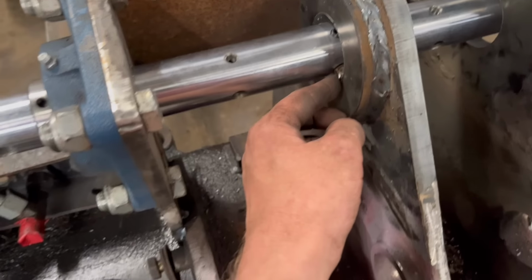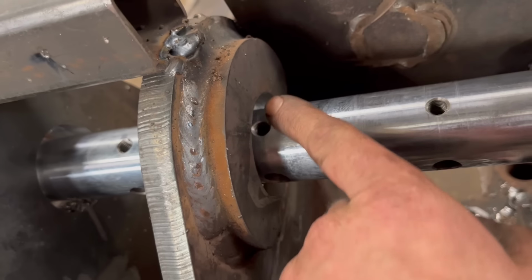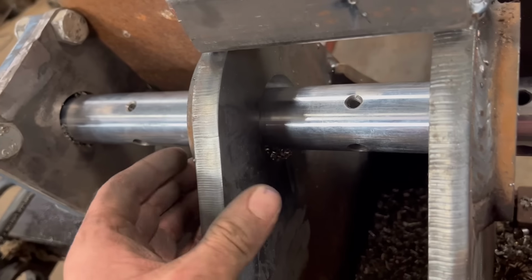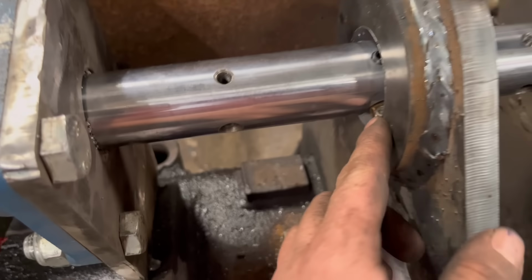Right, so I'm through both sides now. This second side, well, the second half of the first side as well, was real chattery. You can tell by the chips. That was like the chips out the first half. That was when it was doing the intermittent cut, and I don't think it had a chance for the harmonics to build up. So the second one, I was varying the speed a little bit from slow to fast just to try and get rid of the harmonics,